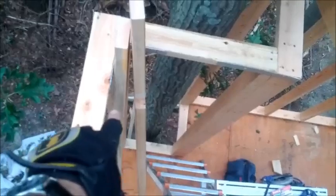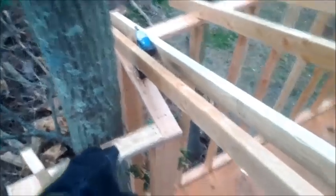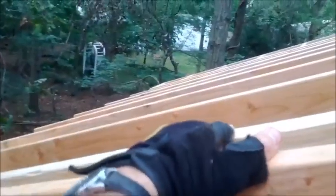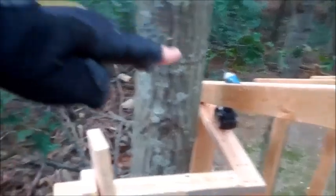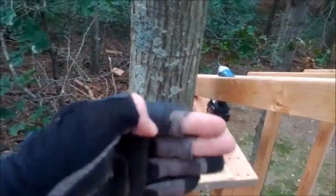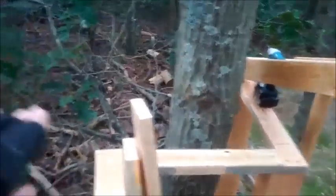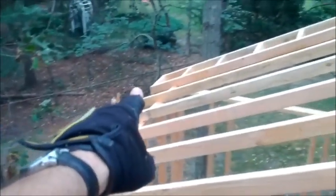Right here we have two pre-cut pieces to build the soffit that's going to hang off on this side. What I still need to do is make two more rafters that will land here, from the top of that wall in front of the tree up to this header here. Because I want to maintain the same line of the roof, you can see they don't actually rest on that header. So what I'm going to do — probably next weekend — is take some 2x on the plane of the roof and run them out here. I'll clamp them to the installed rafters, bring the new rafters up to the bottom and clamp them on, and with them just hanging there in place, take relative dimensioning and measure for the little knee wall I need to build here. I'll fit that wall in underneath the rafters while they're hanging — I figured that was the easiest way to make sure everything fits together and carry the plane of the roof across. Then from here out I'll have that same 12-inch soffit, so the soffit that runs along the bottom will run along the side and along the top.